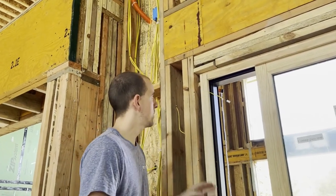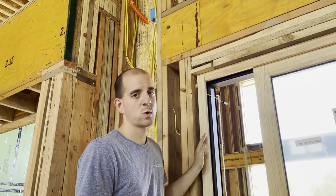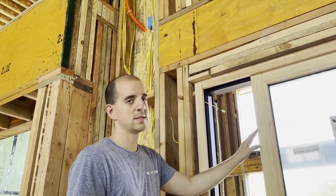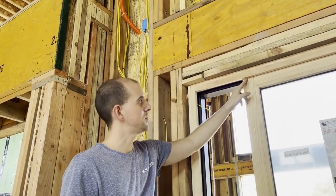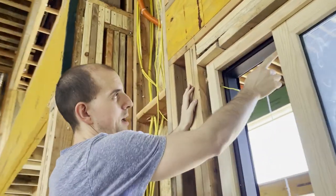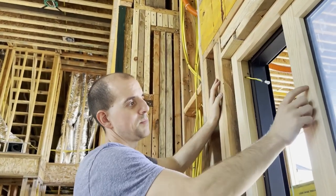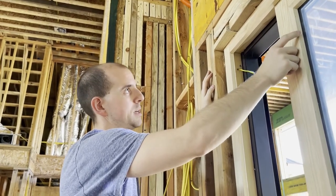Let's talk about how to do a wired contact on a sliding glass door. This glass door and its frame were delivered as a single piece and installed as a single piece. There's no way to disassemble it, which means there's no way for us to drill in through the top portion of this particular door. So instead, what we've opted to do is put the alarm sensor here on the side, and then it'll have a magnet that's drilled in on the matching side. We've got a nice solid big piece of wood here, so I'm not worried about drilling too far into the actual glazing.